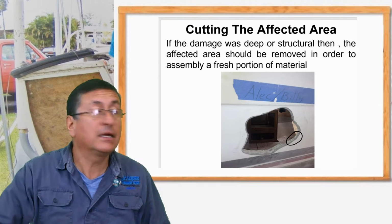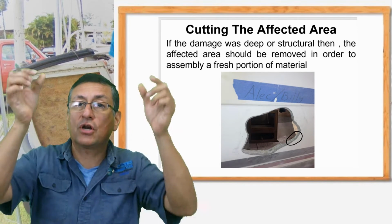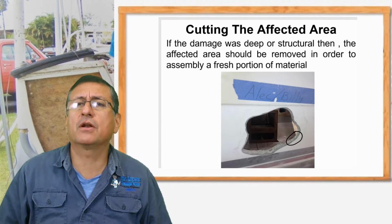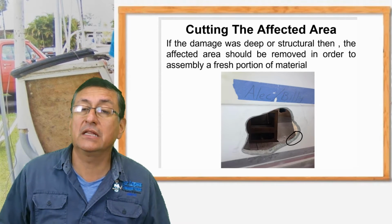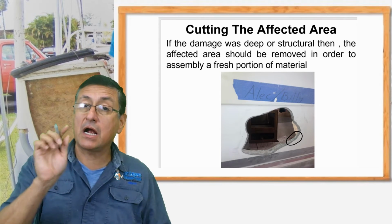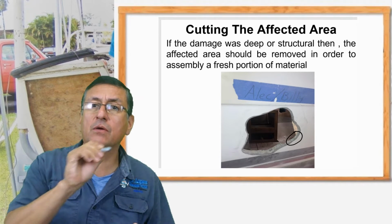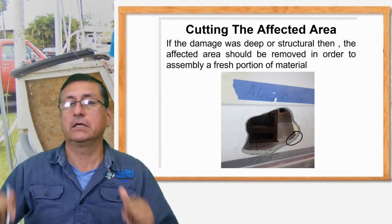The first step is to cut the section that you want to repair, and verify that internally the structure, the bulkheads, the ribs of the hull are in good condition. If not, those ribs can be repaired also. Alright, we are going to cut exactly the portion that was affected in the accident, and after that, with a cardboard, we are going to mark exactly the area that we need to prefabricate outside. In the cardboard, with a marker, you mark exactly the dimension of the area that you need to fabricate outside. Right?